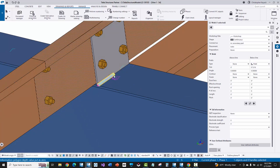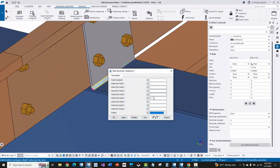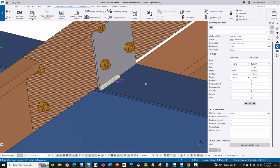Up here on the staggered weld, you'll see two separate polygon welds. Because in the slide rule INI weld options I told it to put in polygon welds, it's actually putting in a polygon weld with a start and an endpoint, which allows me to control the distance or length of that weld. If I go to properties, user defined attributes, this is going to have an 'A' on it — coming from the weld code in DS_weld. Cortex will see any welds designated as A as automatic, and Cortex will apply that weld exactly as it sees it from the model. So C is for ignore and A tells Cortex to actually do that weld.